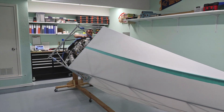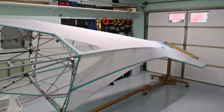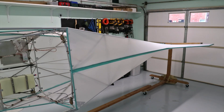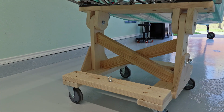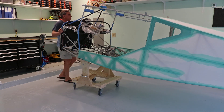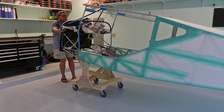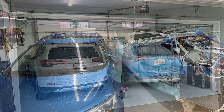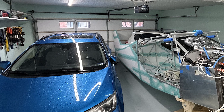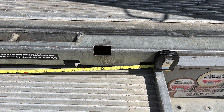The first thing I needed to do was to remove the whole fuselage from the rotisserie. The setup served me well but the fuselage was getting just a little too heavy for it, as the small wheels bind up when I try to move it and I was always tripping over it. So I built this carriage cradle of sorts. It's sturdy and agile enough to allow easy moving the entire airplane within a confined space, which comes in handy when I need to get both cars and the airplane into the garage when the Texas hailstorms arrive. This will also eventually make it easy to move to a hangar and paint shop, as I made sure the caster wheels are mounted narrow enough to fit on a U-Haul ramp.